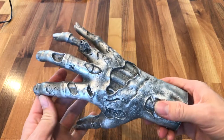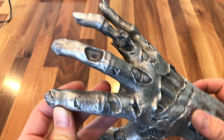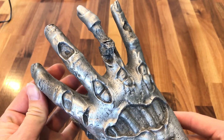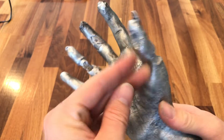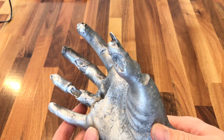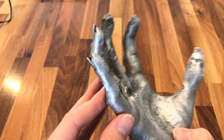After I cut up the sprue and vents, I wire brush the high spots, and it's done. As you can see, the joint compound did a great job capturing detail. I actually like how this turned out. It's not the best thing in the world, but it looks pretty good.